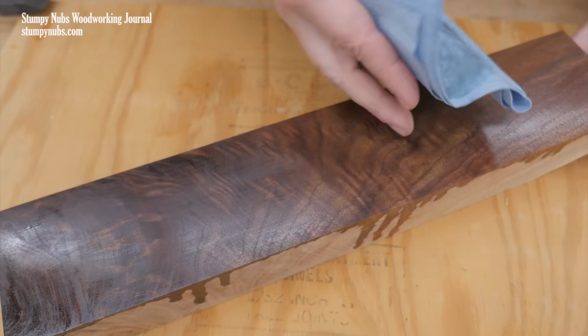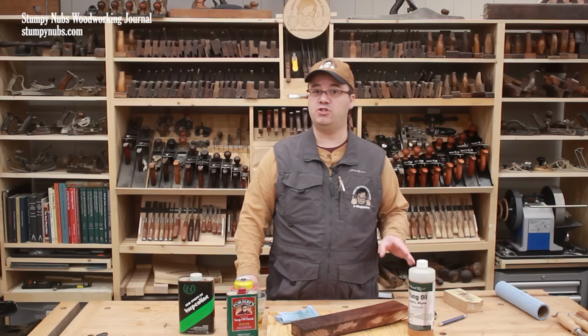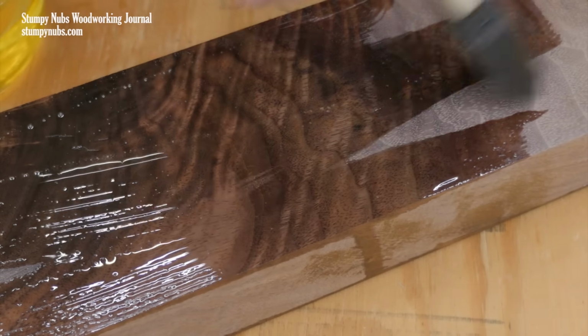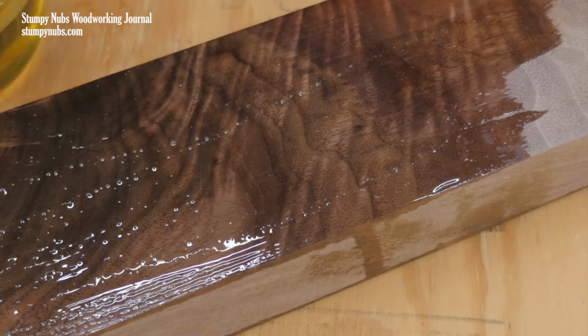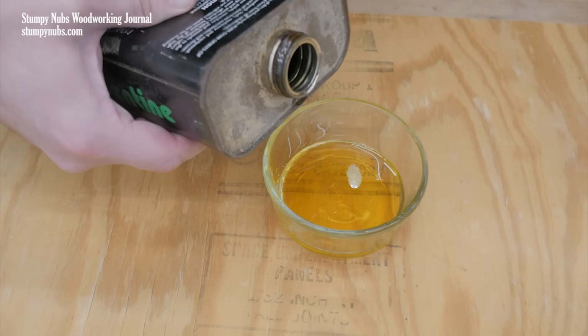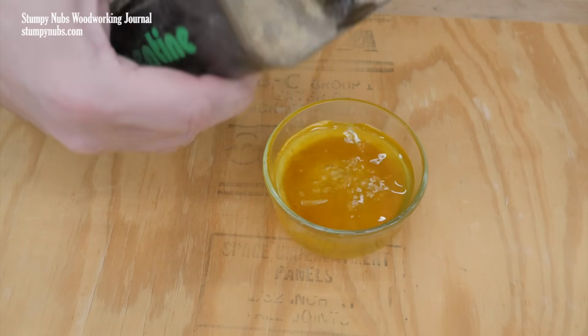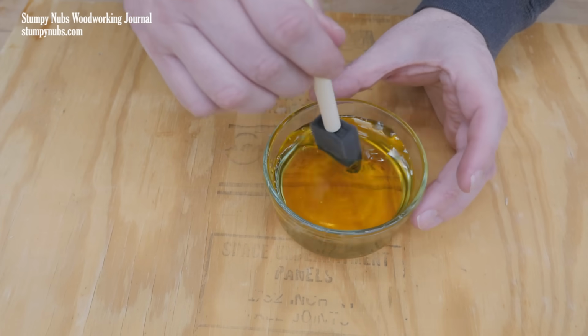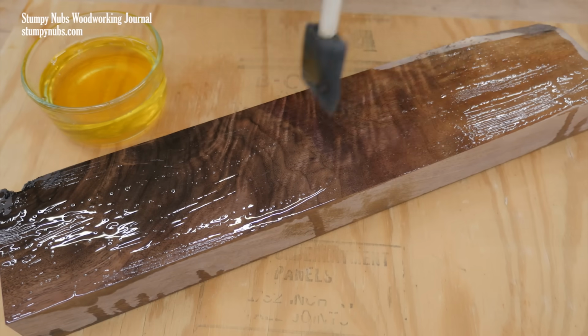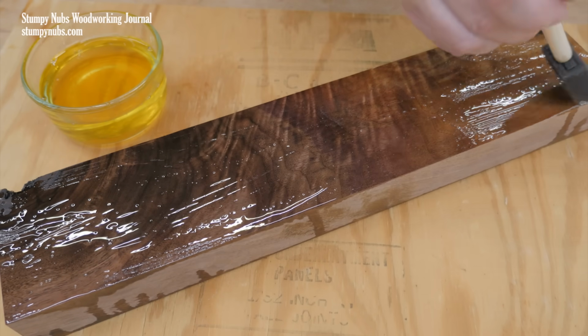Blended tung oil finishes are much thinner, so they soak in faster and perhaps go deeper into the surface fibers. This is a good thing because the deeper the penetration, the better the protection. You get the same effect from the pure stuff by thinning it about 50% with turpentine or mineral spirits, or white spirits some people call them, or even pure orange oil if you don't have access to petroleum-based solvents.